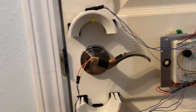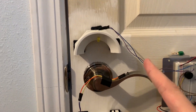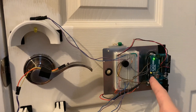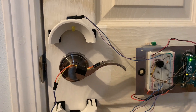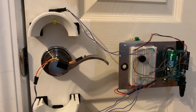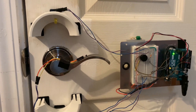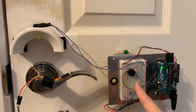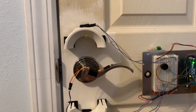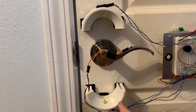The way that the device works is that you touch the thermistor. It reads the temperature. It decides whether or not the difference between this temperature and the set point that you have put into the code is greater than 2.2 degrees Celsius. And then once it decides if it is greater than 2.2 degrees Celsius, it will wait for one and a half seconds. This speaker will turn on for about half a second, and then waits an additional 2 seconds, and these lights will come on, turning on for 6 seconds.